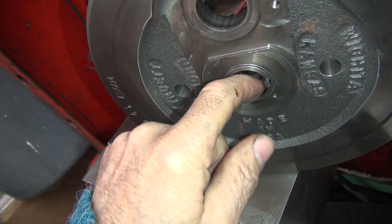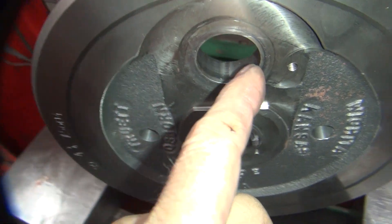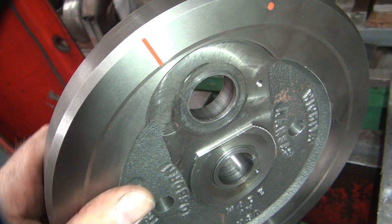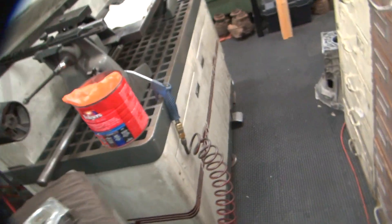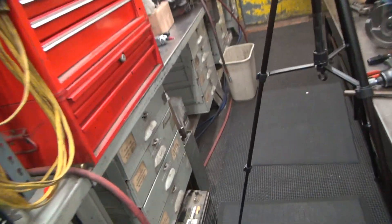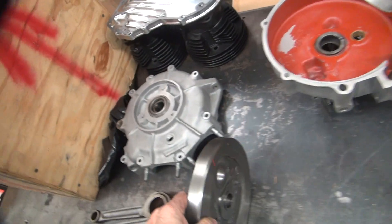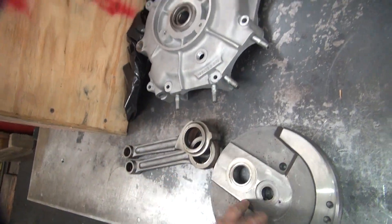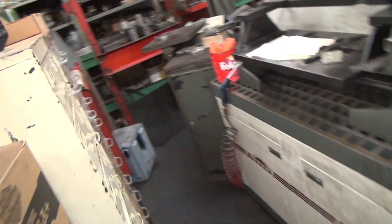Tapers don't look too bad. You can see the chatter marks when they cut them — they're done with a reamer it looks like. Reamers are what everybody thinks are good, but they leave chatter marks like crazy. Cutting them is better; cutting costs more money. Tapered reamers are easier to come by, and they all work.